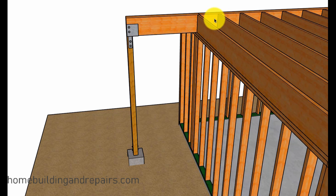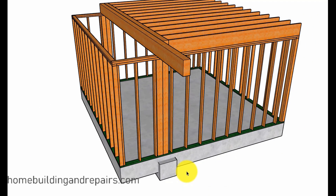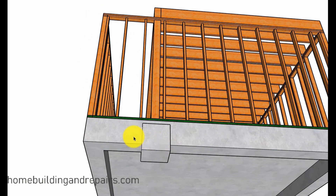There is another option — simply installing another beam next to the existing beam. This is probably going to require some additional concrete footing work. You can see here where the beam and the post kind of centers in this footing, so this was designed for this load accordingly. I don't know if the footing would need to be wider or deeper — that would be up to the engineer. But you can see here where it is no longer centered.